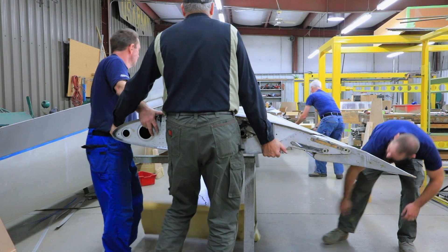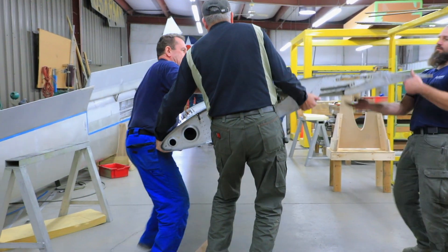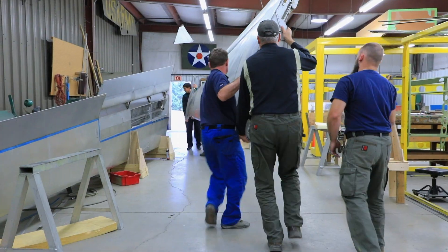It was mentioned that if the fuselage is modified, a new set of wings could be purchased — it's almost a new airplane. At that point it is essentially a new airplane with a 6,000 hour life limit. The original aircraft from 1966 had no life limit — it was conditional. So the owner has the option of purchasing new wings and placing them on the modified fuselage, giving a 6,000 hour life limit and essentially a new aircraft. We haven't yet broached that topic with the owner, but we have options.